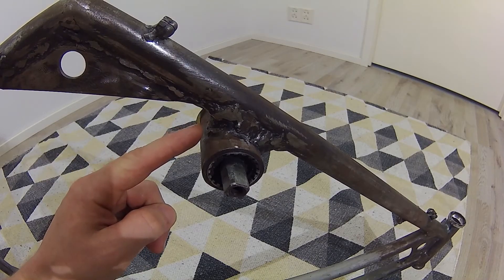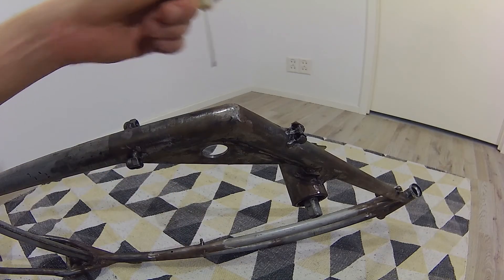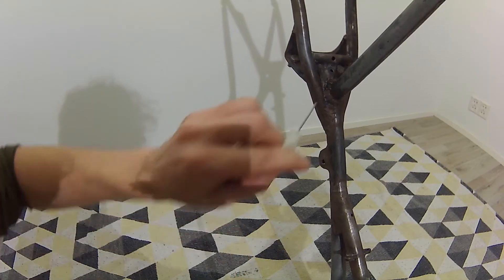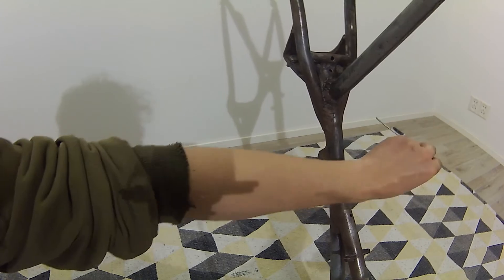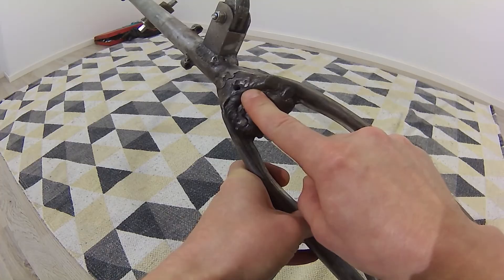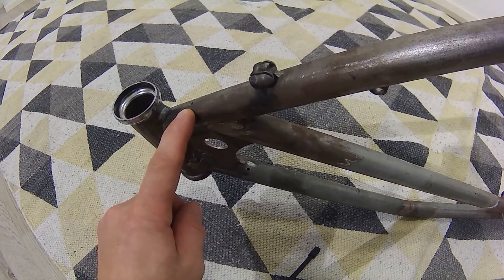Here are a couple of things you should know about welding a bike frame. These welds look terrible and I'm not a bad welder — I do use a flux core wire MIG, but that's just half of the challenge. To keep the structure while welding I decided to minimize the warping of the metal that happens because of the heat. That means making the final welds by tack welding: first you tack the parts together and adjust them, then you do a lot of tacks as the final welding all around the frame, moving from one side to another so you apply the least amount of heat on the same areas. The result looks somewhat terrible, but it's totally solid and the frame will stay straight after welding. You also need to drill holes in the tubes before welding shut both ends, so the pressure that builds up from the heat has a way to escape while you weld — this is very important.